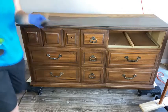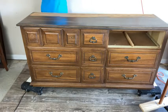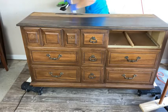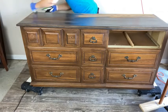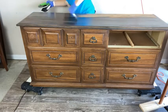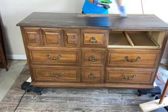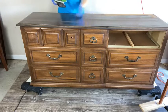brush first. I'm gonna grab a little bit more weathered gray on my brush back here to automatically mix in a little bit. So you can see I put that on my plate, so I'm kind of mixing a second color over here. Just like if you were working on canvas, you can mix your stains up. So it's giving me a really pretty gray, almost black look with a little bit of brown still streaked in it. You can even scrub the stain in. Like I said, this is a very grainy wood. And I'm just giving it a nice thick coat because like I said, we're gonna come back and we're gonna wipe this back. I want to mix it up though a little bit. I don't want it too much of one thing in one spot.